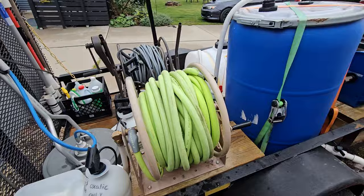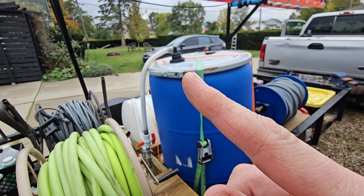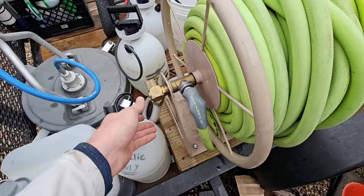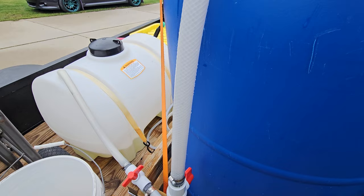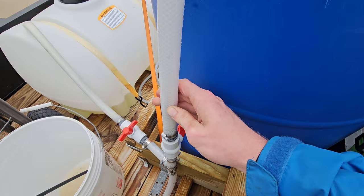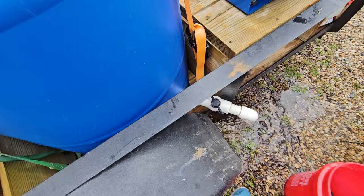Here I have a 55-gallon drum with a Hudson float valve that comes off the hose reel. It's clamped with three-quarter inch off of some barbs — a three-quarter inch barb. This is just poly braid. You're really supposed to use non-collapsible, and in my ignorance I thought this was non-collapsible, but it's not. Obviously here it works well. I have a dump drain here.